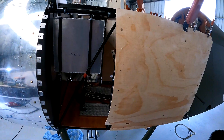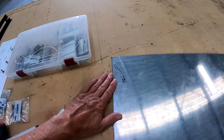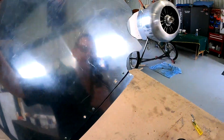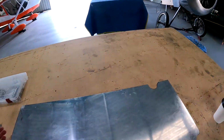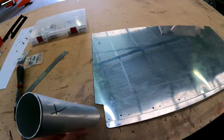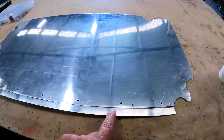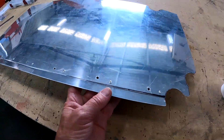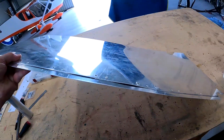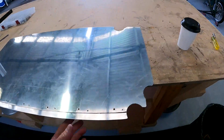It's coming along nicely. Just trimming the side panels as required, cutting out some radiuses that I had marked. I decided I might as well just use a 2-inch tube and go with 2-inch radius everywhere to keep things conformal. I'll do the same up here - mark that one, make that a 2-inch radius. I've got this tongue piece that's on. Interestingly, when it's flat it all bows out, but when it's in situ it fits nicely. So I've got to remember to rivet that when it's back on the aircraft.